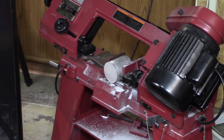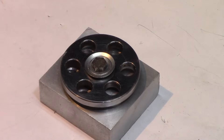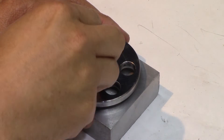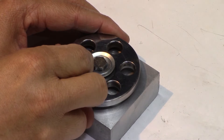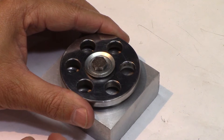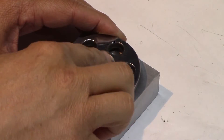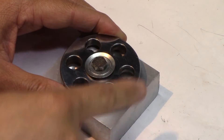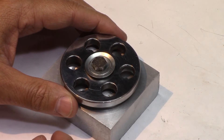While I'm cutting one over on the lathe, I'm machining another at the same time. The way I got this to work is: I put a washer here and bolted that down. I drill a hole anywhere, and then once I've drilled a hole, I move this around to the indexed hole, put the pin in it to hold it in place, and drill a hole. I lift it up, take that off, slide it around to the next one, index that in, and drill a hole. Doing that around the edges, when I found my two holes that were good, I used those two and pumped them right out.